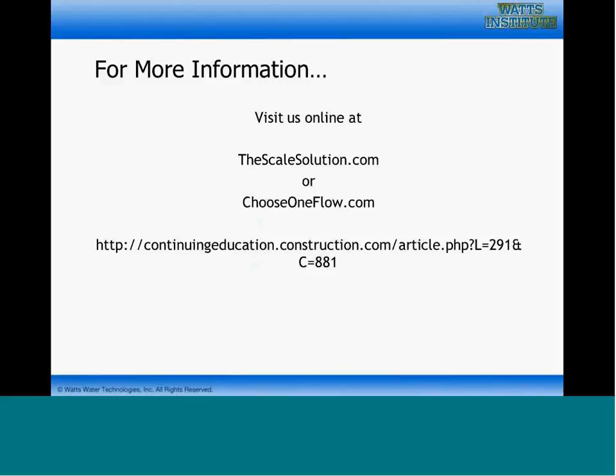Another example could be with a dish machine. You could soften after OneFlow on a big property, and you had a specific application where you were softening specifically for a dish machine that had wine glasses, and you wanted the wine glasses to come out with a beautiful spot-free rinse. So you could argue that you put a point-of-use water softener in that application after OneFlow. So that's where the technologies can complement one another.